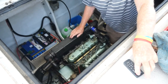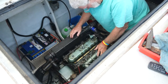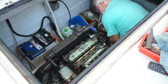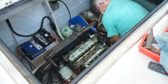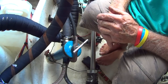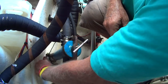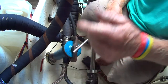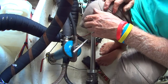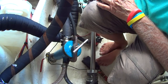I've just been told off - I've got to put another shirt on because this is one of my good ones. Okay, an old shirt and another pair of glasses so I can see what I'm doing. Before we do any work on the coolant side of the motor, especially when it involves the raw water side, it's always a good idea to turn your seacock off. Isolate the salt water coming into your engine and then you're not going to get any flooding in the bilge or anything like that.